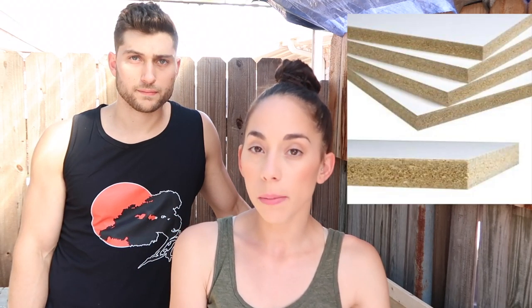Great news, we finished the frame. Time to set this board in place, and then we're going to start mixing and pouring cement. We're gonna clean out our frame first. Another thing, we're not using melamine or any laminate type of wood that's already smooth so that the concrete doesn't stick to it. Since we're using pine boards instead, we do have to oil them up beforehand. If not, then the concrete will stick to it.